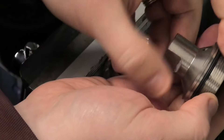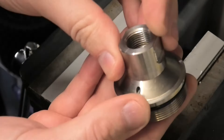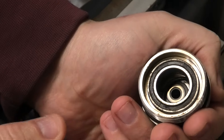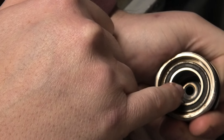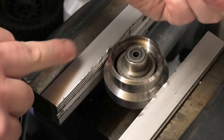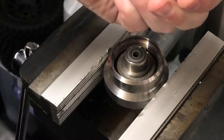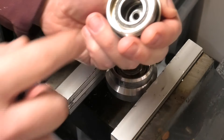There you have it — there's your o-ring that basically seals it up. All around the outside was covered in a thread compound — not really a thread lock, more like a compound. Inside you can see your bearing and your carbide seat right in the back there. Don't damage that — they're very expensive to replace. Same on the other side: they mate up together, spin, and are a machined surface — rock hard. Do not damage them.